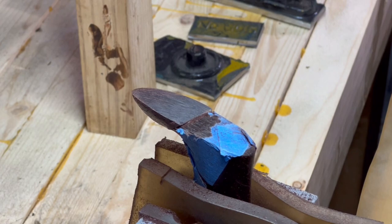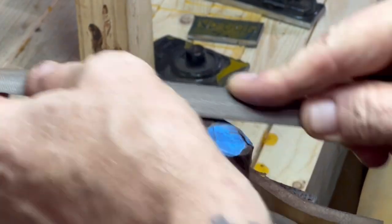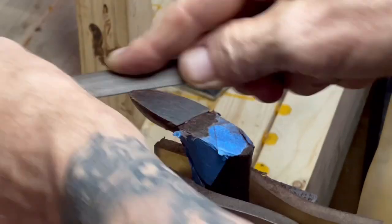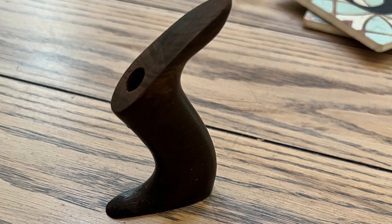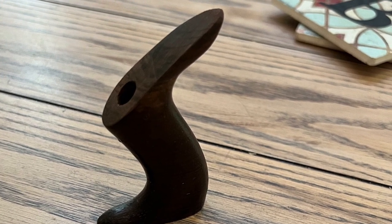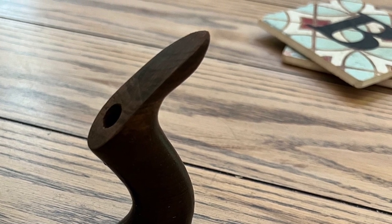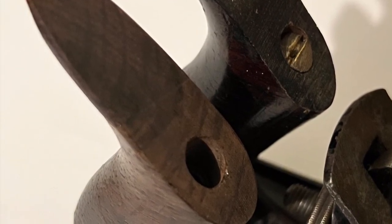If you're looking at my vise, you're seeing a urethane sheet, which is what I use. Rather than just soft jaws, I like to wrap my parts in urethane sheets — this is a quarter inch thick, about 40 durometer, which is the rating for softness. Urethanes go from super soft, like a pencil eraser, all the way to bowling balls. It's a really soft approach that allows me to squeeze the part securely. We've got a joint that looks pretty close to done, but I'm not paying attention to final dimension yet — we can always remove material; we can't add it without starting over.